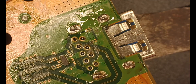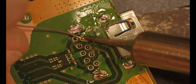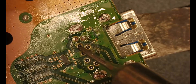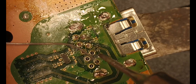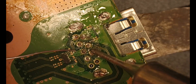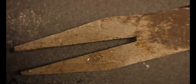I think I had the wrong tip at this time — I didn't really like it, so I switched to a better one. The solder wasn't moving around very well so I had to turn up my heat to 480 on this as well — it just wasn't flowing very well. So you do the legs and then you do each little pin. I'm just feeding that solder in and filling it up until the hole is completely filled, and it's kind of overflowing a little bit — just like a little cone sticking out with the pin in the middle, because the pin needs to make contact with the pad all around it. You just want to build up that solder so it gets a good connection and doesn't wiggle around.